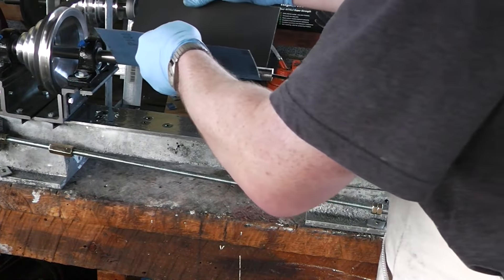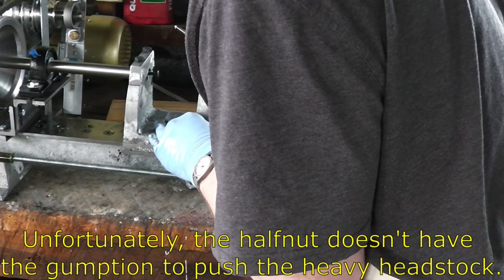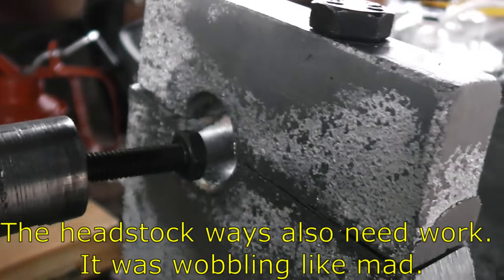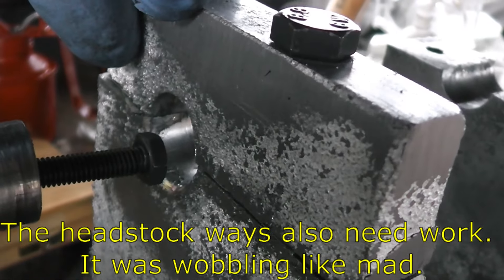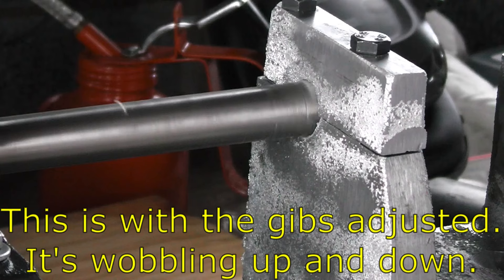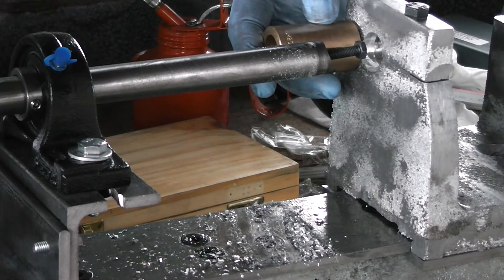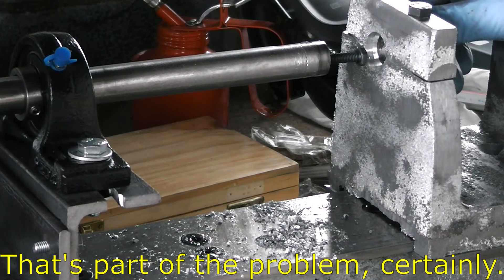So now we're using a boring bar. You can see the lip here that it started to cut. I think I may need to make my cutter shorter and take smaller bites at the apple. This is the bearing I'm sizing it for, so there's still quite a while to go on it. Well, it's kind of working. I think the cutter geometry is crap.